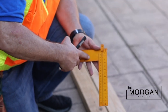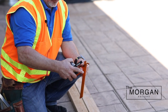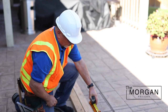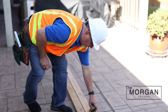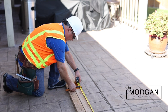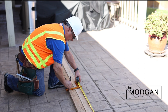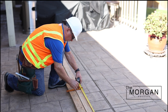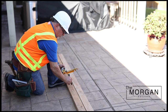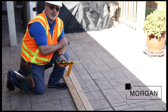The inch-and-a-half mark is for when you're doing an opening in the wall, such as a door or a window. Simply measure out to where that opening is going to be — in this case, 39 inches — make your mark, mark both sides, come back out and mark it again. You now have all three markings: your king stud, your trimmer, and your cripple stud, all in one quick, accurate, fast measurement.